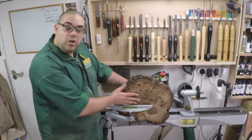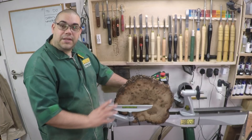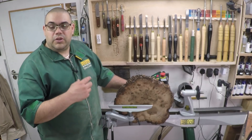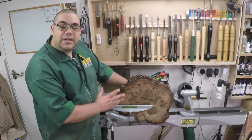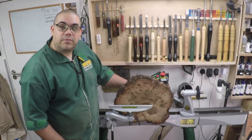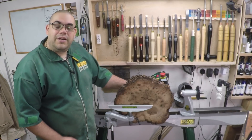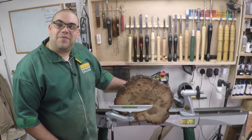The first step is to true up the front. Once I've trued it up I'm going to sand it with a flat orbital sander rather than the traditional methods by hand. This allows it to keep it much flatter and it's much easier to work around the live edge. When I've done that I'll start to work out a design and carve that in.